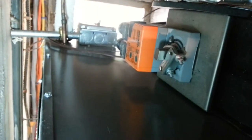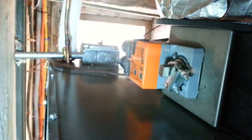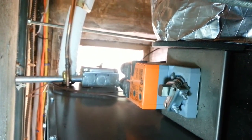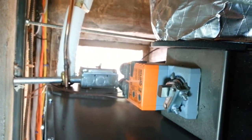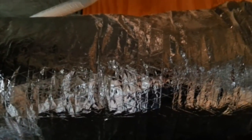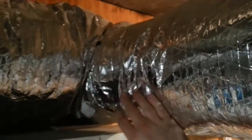Then we have our conventional cooling side, which gets piped like any other cooling side — you have a liquid line and a suction line. Over here on our plenum, everything is insulated. The ductwork on this job starts as 9-inch, but it drops to two 7-inch supply lines, and everything is insulated.